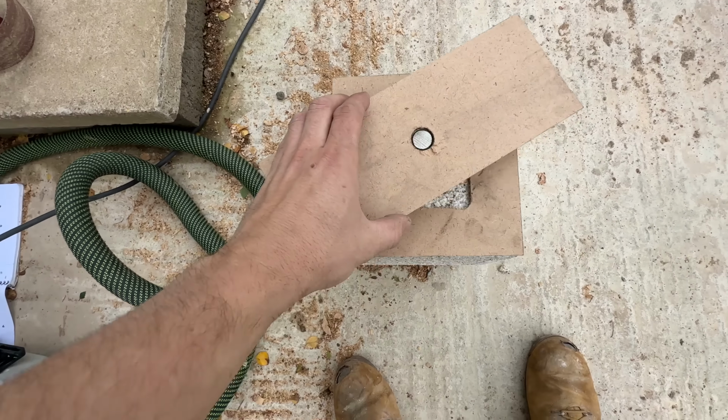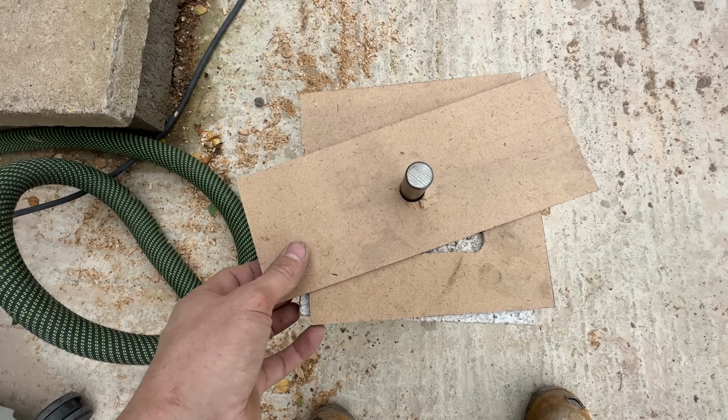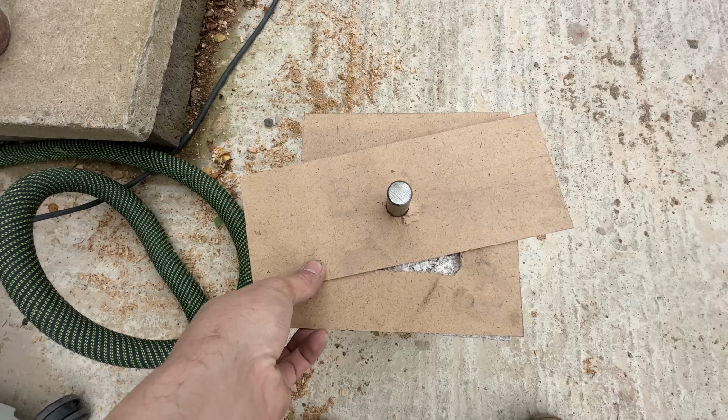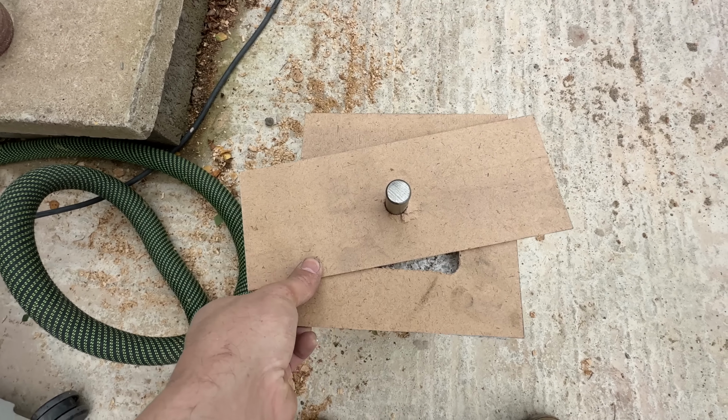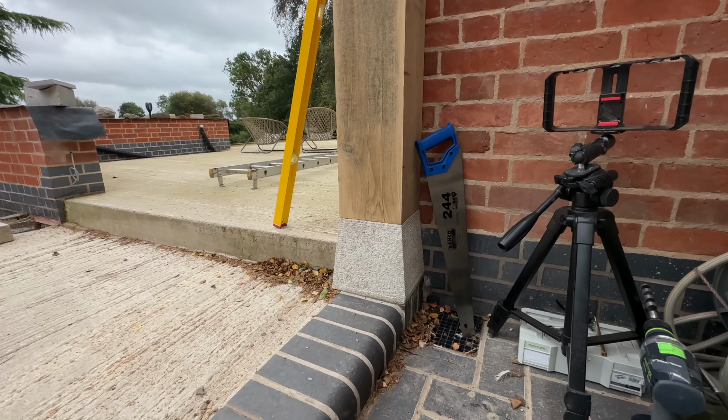And then cut a hole with the drill I'm going to be drilling with. Just put the two together, obviously line everything up when you've got two hands, and just take them off. You can use that on the bottom of your post and mark your hole dead accurately. It worked really well for that first one, so as long as you go off the right face, it doesn't matter if the pin's out in the middle and there's no measuring involved, it's really quick.